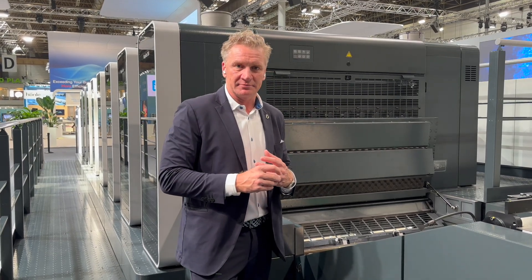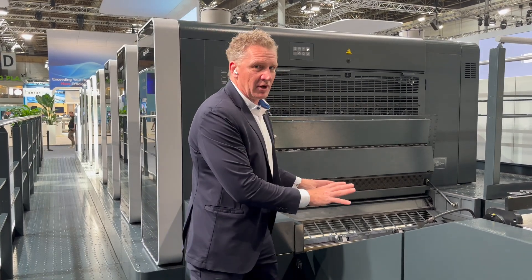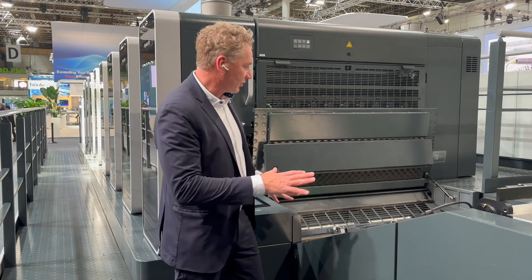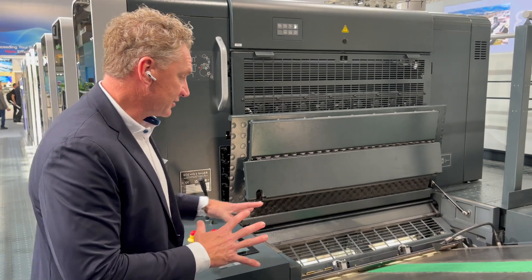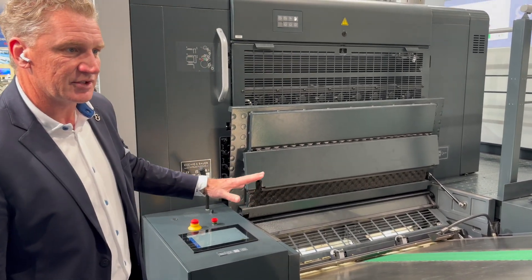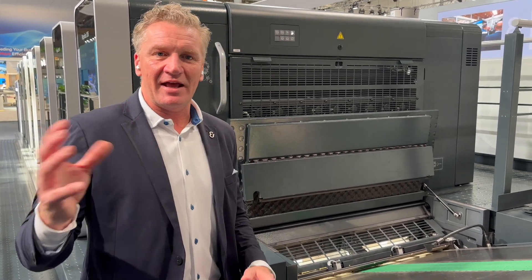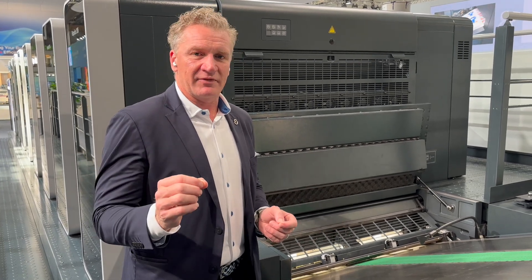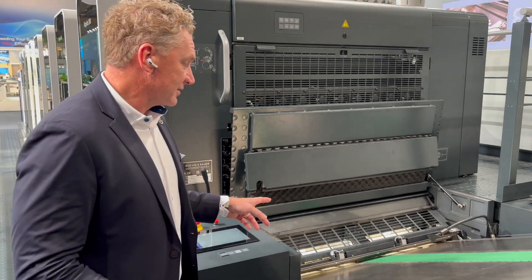What's really nice about the SIS is that there's no drama here. There's no need for sheet guides, corners, or flaps to put down. That means there's no operator needed to do the make-ready changeover from sheet size to sheet size. The SIS is perfect for lightweight substrate, heavy substrate — the complete substrate range. It will benefit every one of these.